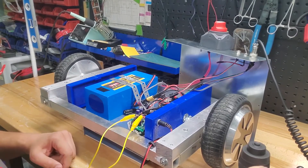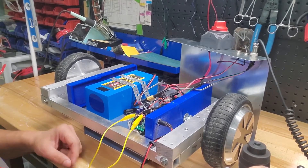I initially started looking at the code to see if there was a fix, but this reminded me of a couple of very important things. E-stops need to be as dumb as possible — brute force, not relying on any code. In this case it's firmware, but it doesn't matter: we can change this firmware and therefore it relies on us not making any errors. For that reason I have to completely scrub the idea of using hall sensors as an e-stop. It is unreliable, and even if I think I can fix it, it's inappropriate to use.